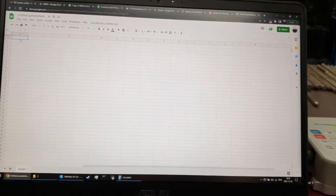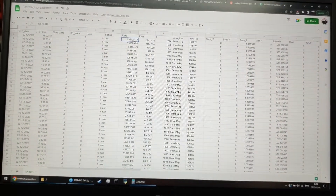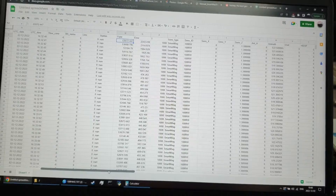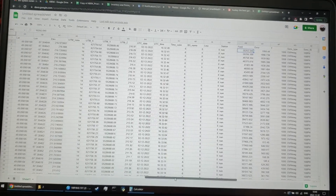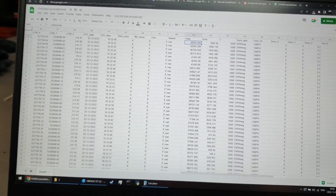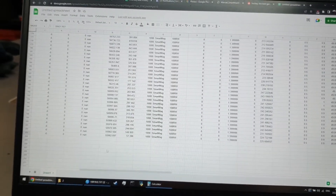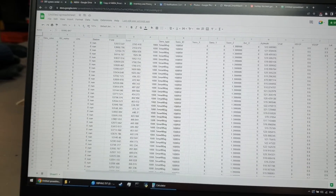It is just plain text, but you probably want to look at it in a spreadsheet or something. You can see the field reading gives you the value of the field in nanoteslas. And then there is another sensor with another field, so you actually get data from both sensors together. If you want to plot this as a gradient, you subtract one from the other — for example, 55,621 and 55,982 — you just subtract them and you get the gradient for plotting. That's all.